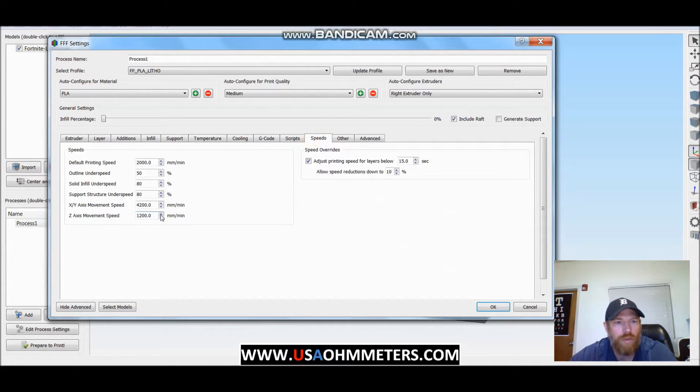With a heated bed of 60 — if you don't have a heated bed, that's alright too, just make sure you have good bed adhesion. Print speed: relatively slow, nothing too fast, so the quality comes out really nice.